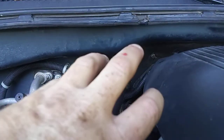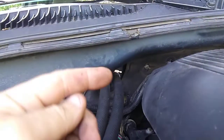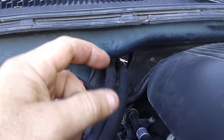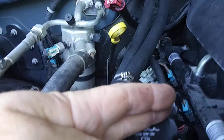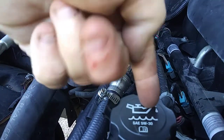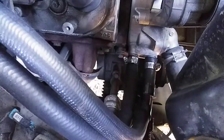What you do is you have to get in there with a sawzall blade — I used one because they're stiffer than a hacksaw blade — one for cutting metal with fine teeth. I just laid it on top of the fitting, took my time, and cut across the full length of it until I could take a flat-head screwdriver in the groove, turn it, and pop the whole fitting loose and pull it off. I had to do that on both fittings.